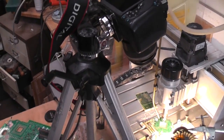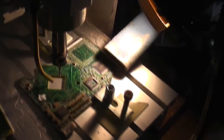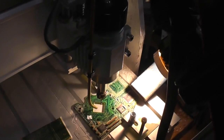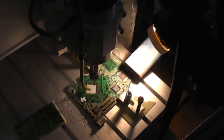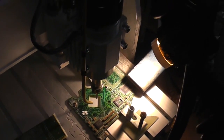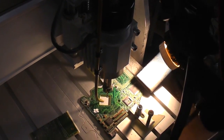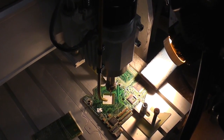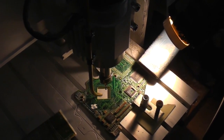We've got the camera over here with the macro lens - it's quite hard to get the camera really close, so I'm just shooting high resolution then cropping out the part of interest. I've also got a very bright LED light here. One reason for really bright lighting is that you want to keep the aperture nice and small to get a good depth of field, otherwise as you dig further down it's going to go out of focus. This is set up on pretty much the minimum aperture. Also it means it's less sensitive to variations in ambient light - if I'm running for over an hour and there's daylight increasing and decreasing, or if I turn the lights out and let it go, the very bright local light means ambient lighting just doesn't make any difference. Even if you're walking past it you're not going to cast a shadow over it.